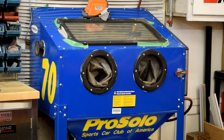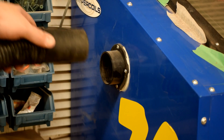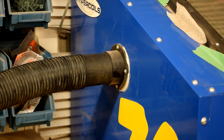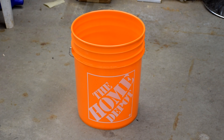So we want to get rid of that dust, and that means making use of a feature in the cabinet that I haven't used up until this point. There's this fitting on the side of the cabinet that's designed to fit an exhaust hose. This cap comes off, the hose from your trusty shop vac just clicks inside, and now you can apply negative pressure to the blast cabinet so it'll suck out the dust without taking away your media. That's fine except that the dust is so abrasive it'll very quickly wear out the motor inside your shop vac. So we have to put some sort of particulate trap in between this connection and the vacuum. We're going to convert this unassuming Home Depot shop bucket into a particulate water trap.